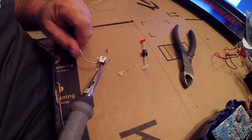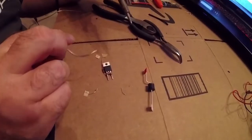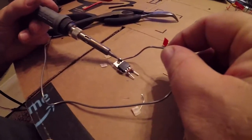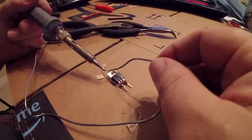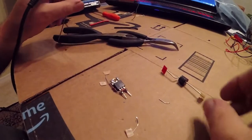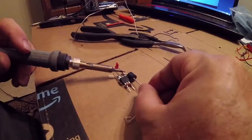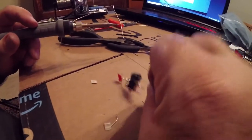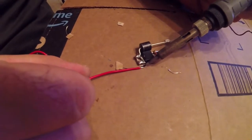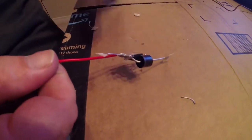We're taking our 2.2K ohm resistor and putting it across the two terminals, following the unconventional airsoft plan, and attaching the 100 ohm resistor to the gate of the MOSFET. We'll start by tinning the MOSFET and the diode, then solder the trigger wire on. Looks to be a good joint — we'll clean that up by cutting off the extra resistor wire. This end of the trigger wire will go to the battery with the trigger switch in between, causing the MOSFET to channel the higher current through.